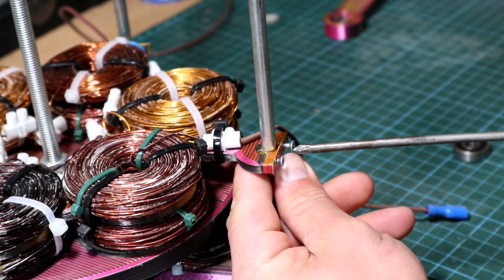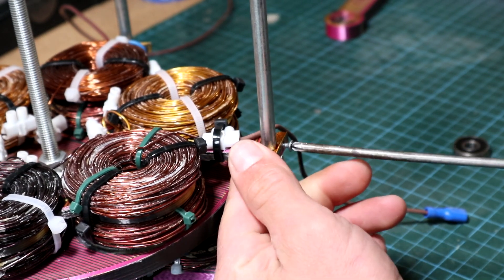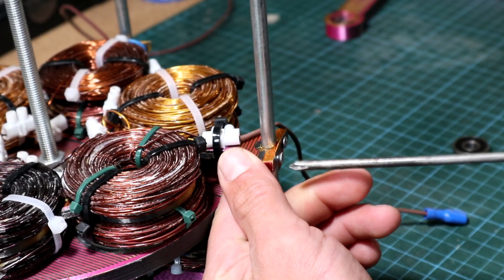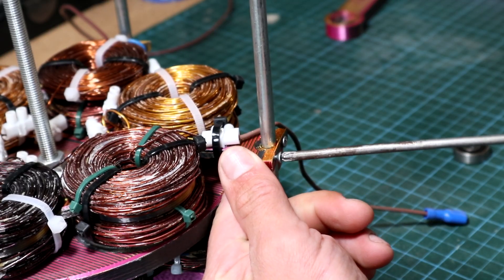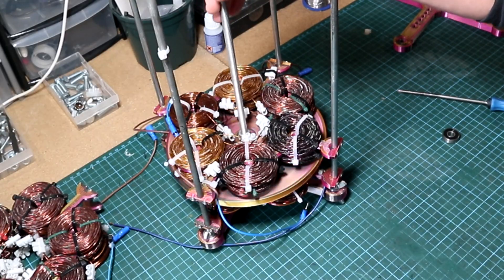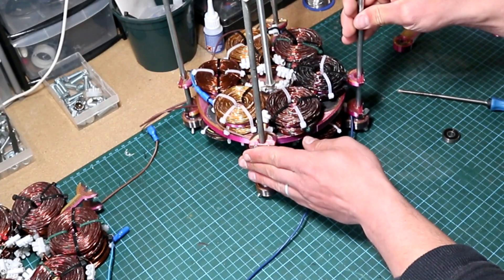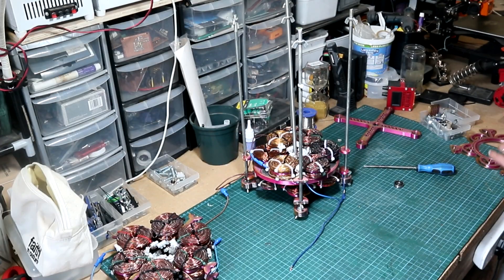Here I have them. I got some screws and bolted them together. After the small brackets are screwed in, the only thing I have to do is adjust them a bit, making sure that the rotor is freely moving and is somewhat close to the coils without hitting them.